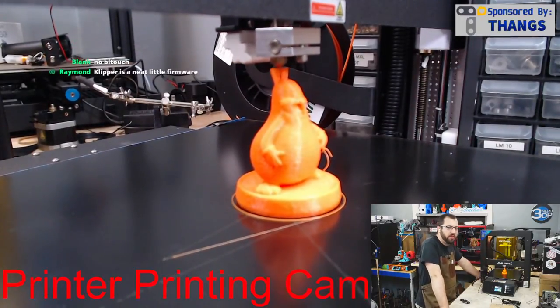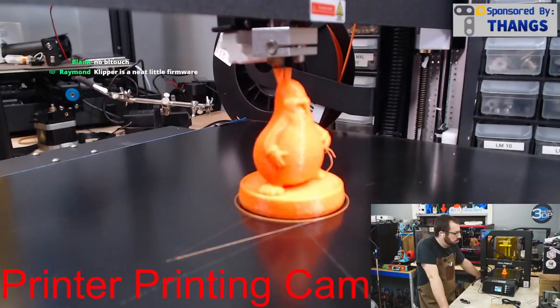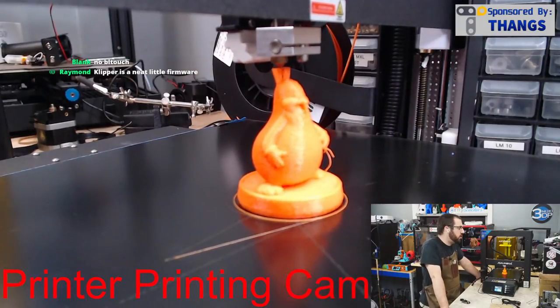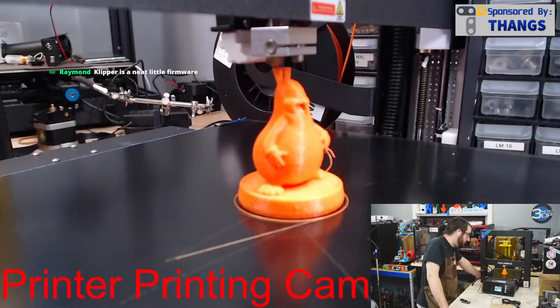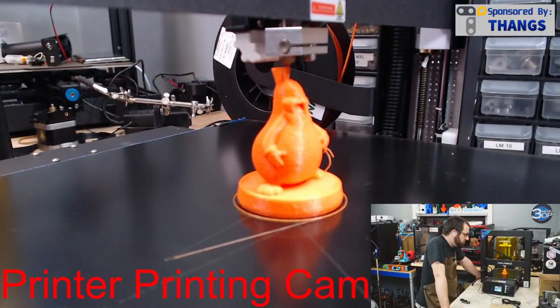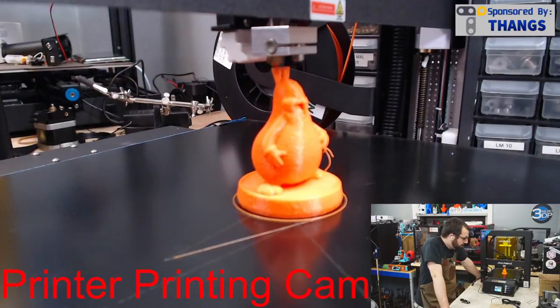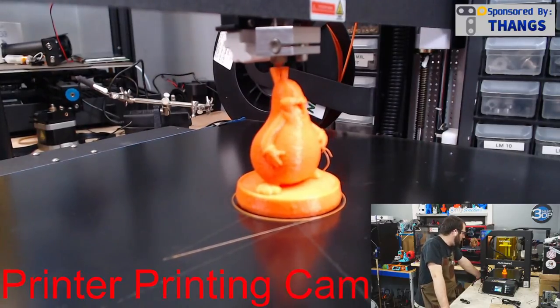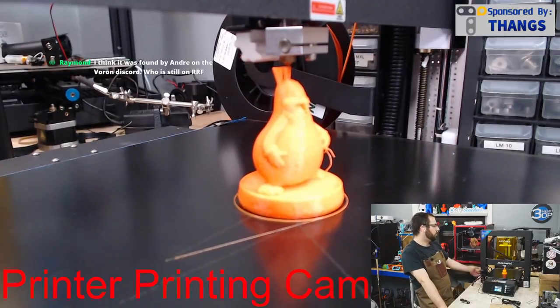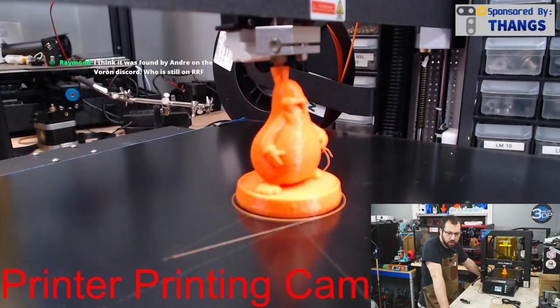this falls under, if you can get a good deal on it, maybe. Buying this new would probably not be worth it. It doesn't have any sort of bed leveling. It's using non-silent steppers. It's got a very basic extruder. Yes, it's got a larger print volume. It's 330 by 330 by 320. It's not aluminum extrusion, so you're pretty much limited on doing any huge modifications to it.